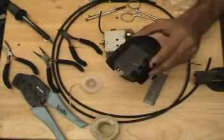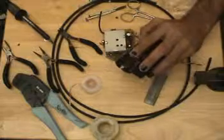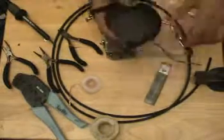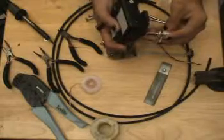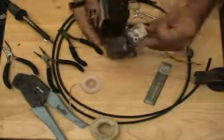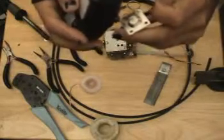Let me explain the RF box. This is a 2.4 GHz video receiver made by X10. It had a panel antenna over here, but it broke. I think this coax is LMR100 — I can't be sure, and because I'm not sure, I can't order the proper crimp-on connector. Once you crimp a connector, there's no uncrimping it. You can solder the center conductor directly in, but then how are you going to ensure the shield properly shields the outer signal? You'd have to bend, flex, and solder the coax, which is what I've done in my other scanner — but it's not the appropriate way of doing things.